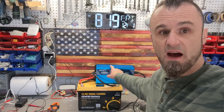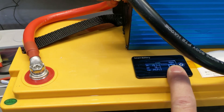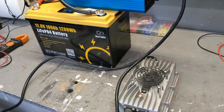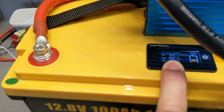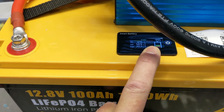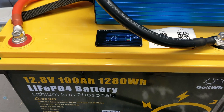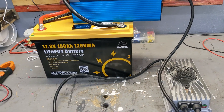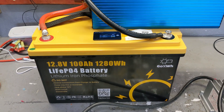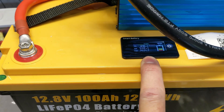The battery got hot and I heard the fan turning on. At 44%, it shut off — it was not able to keep providing 109 amps. So I dropped back to one charger to drain it at around 550 watts. At 44%, as soon as it passed from 45% to 44%, it said you're exaggerating — I'm rated for 100 amps, I gave you 10 to 15 minutes of 110 amps, you've had enough. That's fair. It can take bigger loads for short periods, enough to heat up a microwave at 1,000–1,200 watts, then reverts to normal.